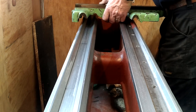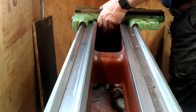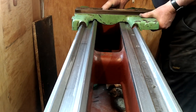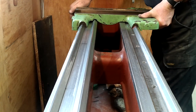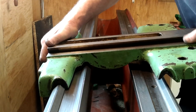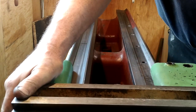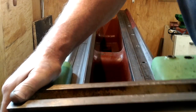At this end of the main slide, the saddle fits perfectly and the red marking pattern on the underside of the saddle is still in good order, apart from being a little bit light at the front and back. The red ink is still failing to show up on the video though.